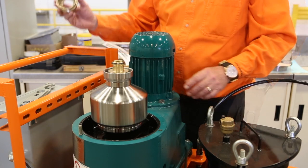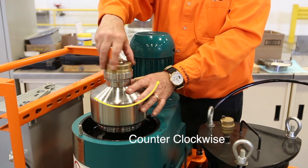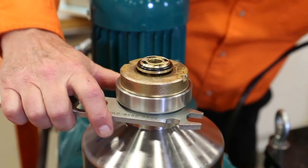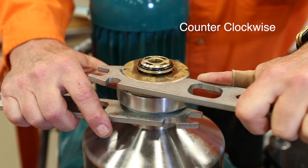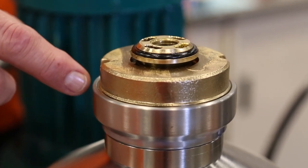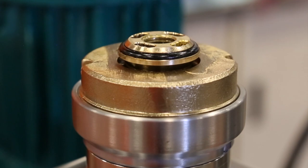Place the centripetal pump on top of the ring. Screw the brass centripetal pump chamber into the lock ring by hand. Using both multi-tools, hook one into the slot of the stainless steel locking ring and the other into the brass centripetal pump chamber, opposite of each other. Tighten the chamber by moving the wrench counter-clockwise. You should see, at most, one thread on the OD of the pump chamber. If more threads are showing, the regulating ring was not centered — unscrew the pump chamber and re-center the ring.